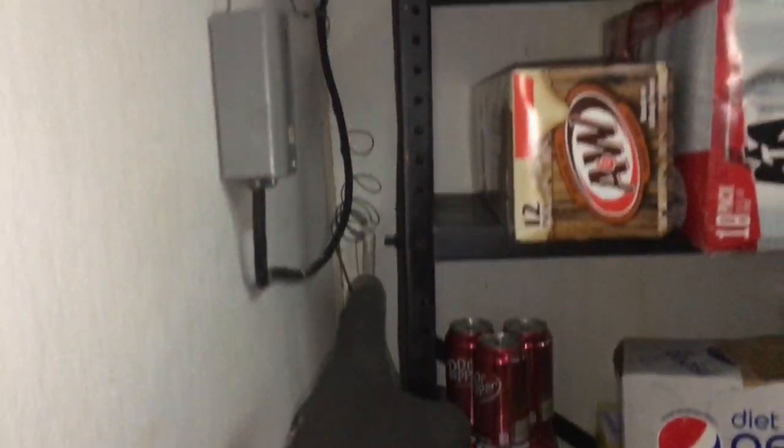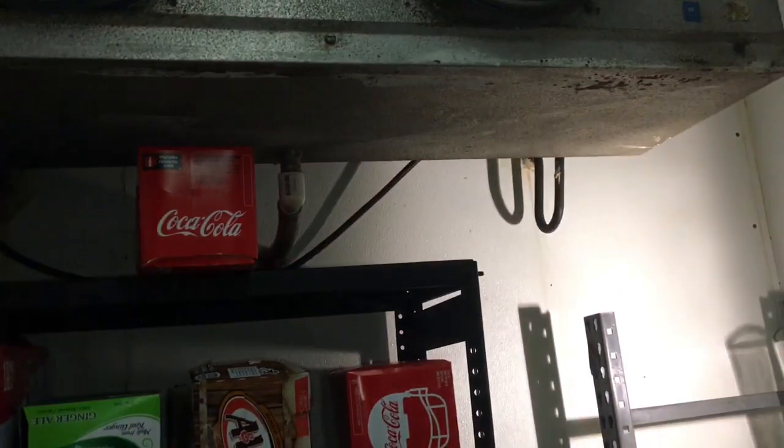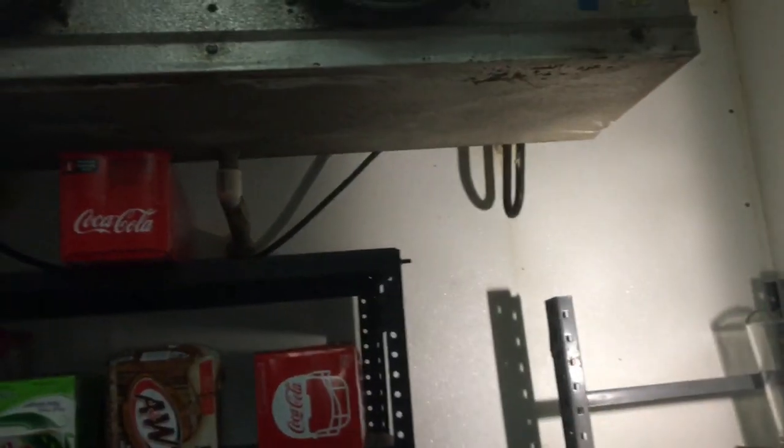I just took the cover off the end — look what I see here. I don't like that. It's probably the sign of a gummed-up orifice in this TXV. That's a Danfoss expansion valve. I don't like that. Another thing I just noticed is the sensing bulb for the thermostat — it's in a dead air space. I don't like that. I'm going to move that up over here and get it in the return air. A couple things to look at, and I still haven't even gauged up on the unit on the roof yet.